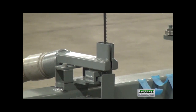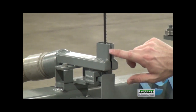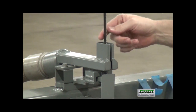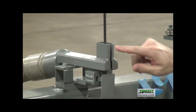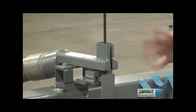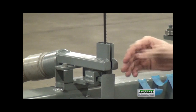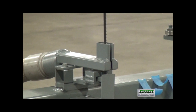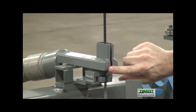We have a trick for increasing the effectiveness of this. You can see here we have a slot on the underside to allow the blade to be loaded in. That blade slot is an escape path for vacuum. We want the vacuum to be focused up, not coming out here or going down. So as a cheap, easy fix, I like to use blue contractor's tape — painter's tape — to mask off this slot.